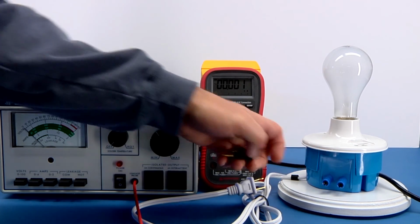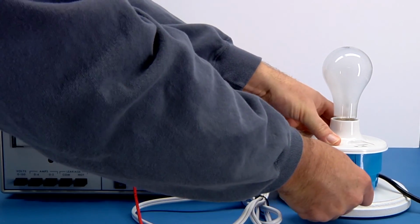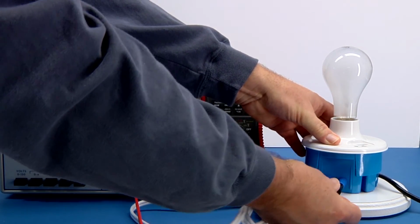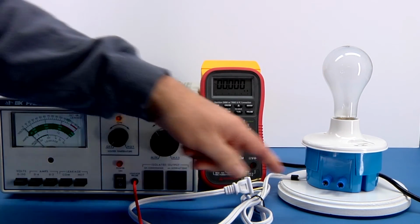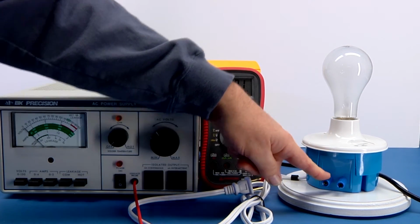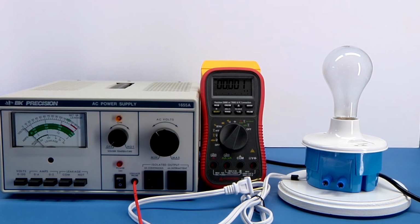And I set it at 3/4 inch spacing, so you could have a shorting plug or something like that in there if you just want to maybe check for voltages or just drive the load. And then another very important thing is you have to make sure you colorize the 5-way binding posts to match the box. So I'll go ahead and stop it just for a second and make the connections.